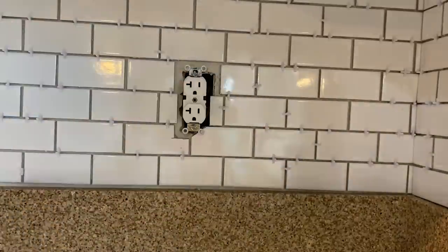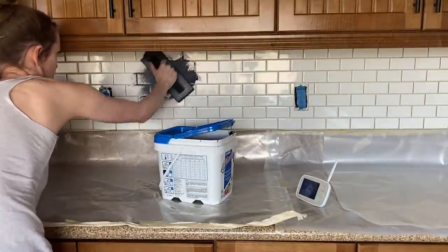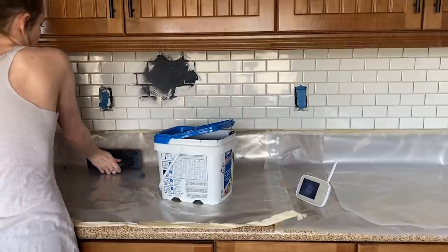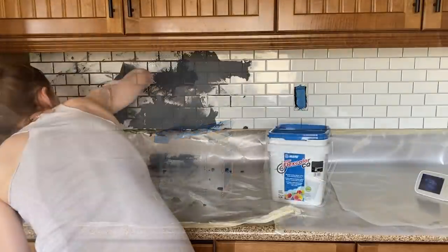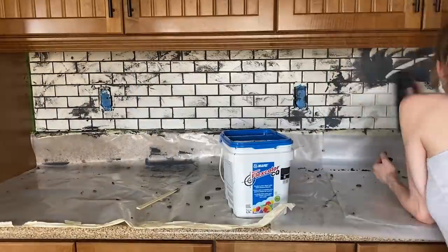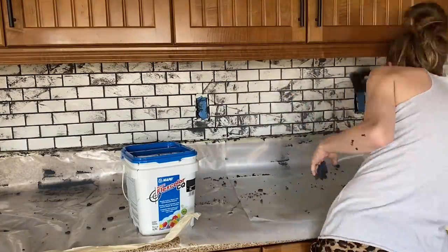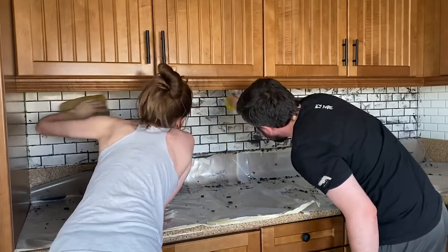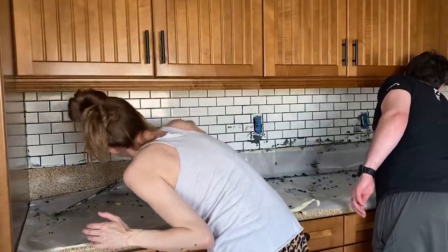After my minor tile cutting kerfuffle it was time to grout. I actually really enjoyed the grouting process. I'm using this pre-mixed black grout to add a little bit of contrast and also complement the black hardware on my kitchen cabinets. It has a consistency similar to moon sand and was pretty fun to smooth around the tile with the grout float. I watched a video by Home Renovations on grouting tile — I will link it in the description below. He recommended applying the grout at a 45 degree angle so that you don't dig out your grout lines as you go, and having a clean surface below you so that you can scoop up any grout you drop. After applying the grout and letting it set up for about 20 minutes I wiped off the excess with a damp sponge. It was a pretty hot day and the grout was drying quickly so I got my husband to help, which saved me a lot of time and arm strength.